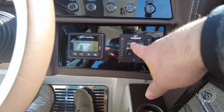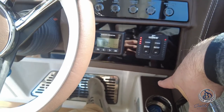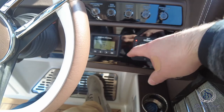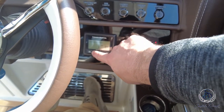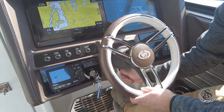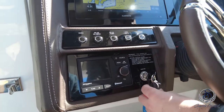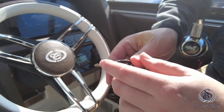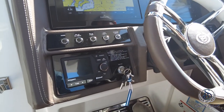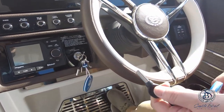If you are anchored in the evening, just turn on your anchor light to alert other boaters that you are anchored and not underway. Trim tab controls are here — if the port side of the boat is riding high, push down on the port control to lower that side. Do it in small increments because it's sensitive. Your EVC screen is a redundancy of the gauge information — scroll left to right to get different engine information. The steering wheel is mounted on a tilt base so you can push the bottom and adjust it up and down. To the left is the ignition. There are several keys: the Cobalt ignition key inserts upside down. The silver key locks the glove box on the port side, and this boat has the optional wireless charger on top of the glove box.